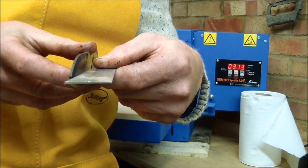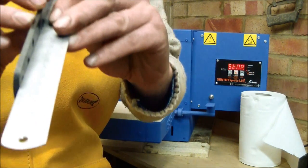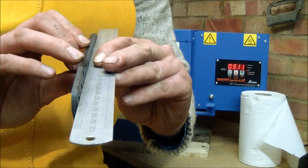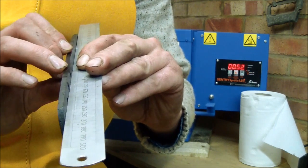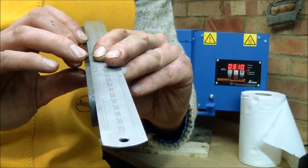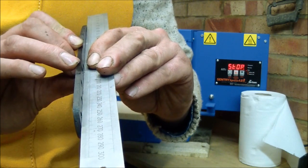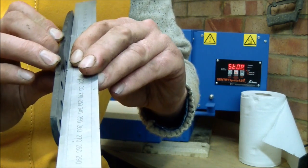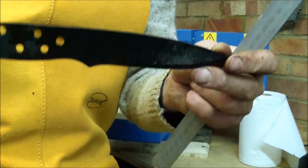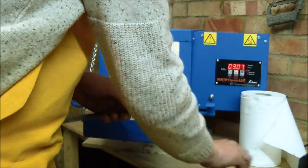The aim here is to get the blades perfectly flat against the straight edge. If the straight edge lies flush, it tells you the blade hasn't been warped by the heating or quenching process. Anything less than perfect is not acceptable at Jackal. That one passes the straightness test — I test each blade.